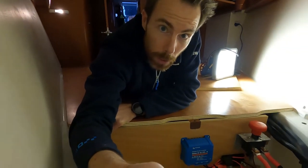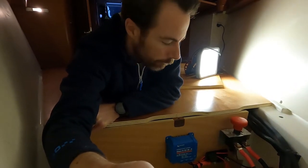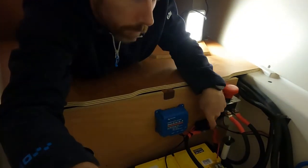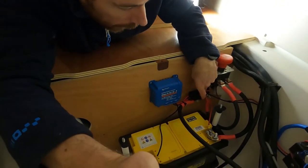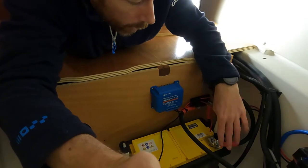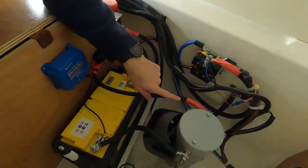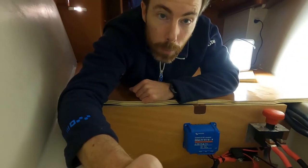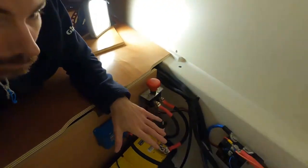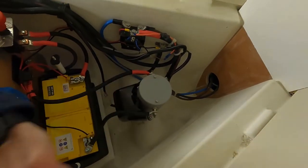I also have to do a bit of a change to the wiring down here. One of my subscribers pointed out there was a slight flaw in the wiring I did - the fuse here, I didn't put it before the main switch. The perfect solution is to have the positive go directly to the fuse, then to the main switch, and then to the thruster itself. I made a brain short circuit during the last days of the install. So first things first - taking off all the cabling so I don't accidentally fry anything, and then we're going to take off the motor and check that out.